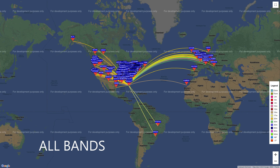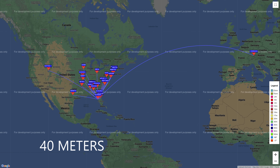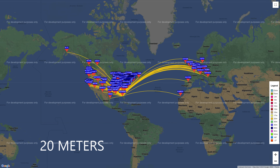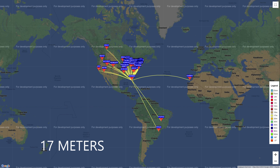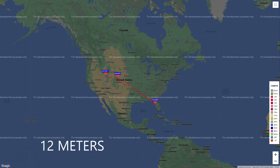I've been using WSPR to do testing on antenna systems, especially when it's the exact same antenna with one variable — does that variable improve or not improve the performance? WSPR does not guarantee the ability to make a single sideband voice contact; the conditions need to be much better for an SSB phone contact versus a very low power, weak signal propagation report type contact. So it's kind of an indicator metric, and I treat it that way. Nonetheless, it does tell us a story that my gutter antenna is actually getting out.